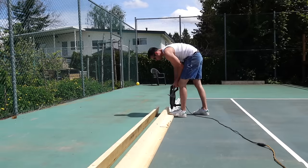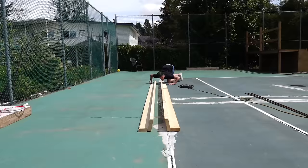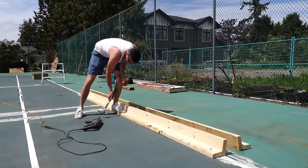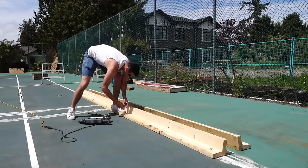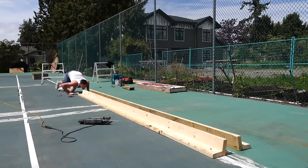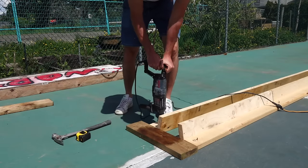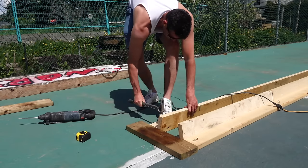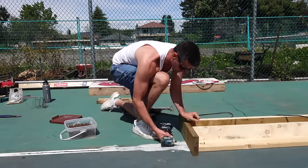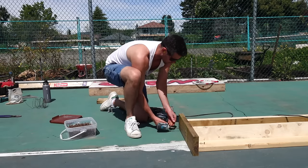Get both ends fastened and then take a look down your board — in this case it needed to go in a bit, so you can see me tapping it in before screwing it. I'll put about one nail in between each of those locations, so about five nails in total for 16 feet. Now is your chance to set the desired width. I made the top about six inches wide, which for a skateboard curb was a bit too wide — I think you should do five and a half for a skate curb, but if it's architectural, make it whatever width you want.